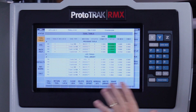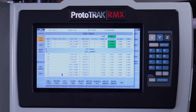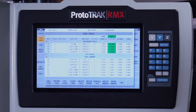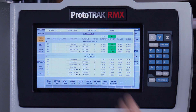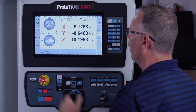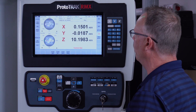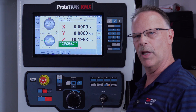The machine knows that the tool in the spindle is also the tool in your library. In the middle it says ATC Tools — in a later part I'll show you how to assign tools from my library into the ATC so it can run in production mode. So I'm going to go to run mode, push start, and after it calculates the tool path it's going to tell me to push go. It'll go to the home position and tell me to put the first tool in — a three-inch face mill — start the spindle, and make the parts.